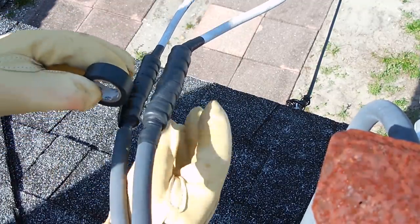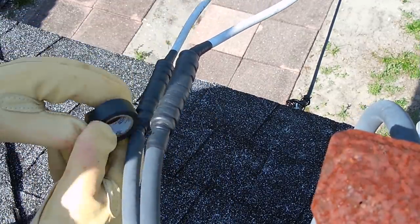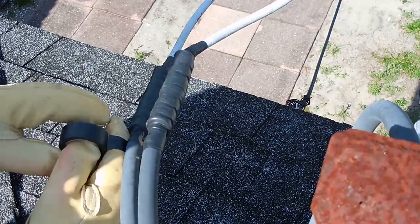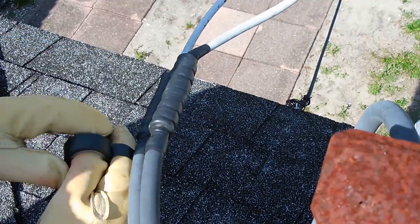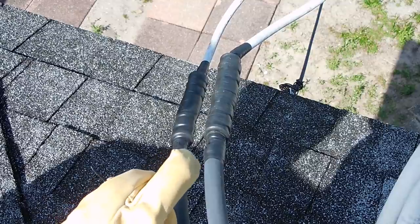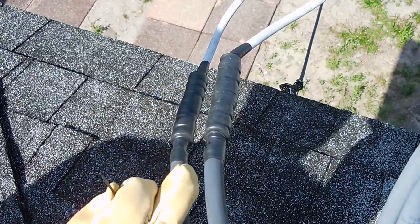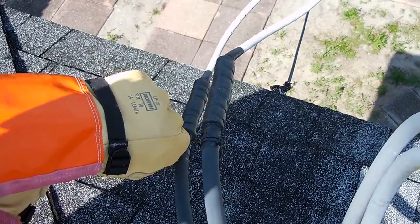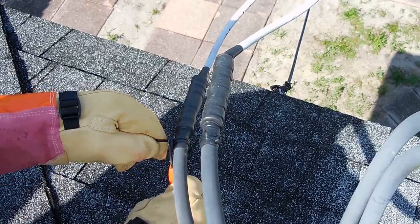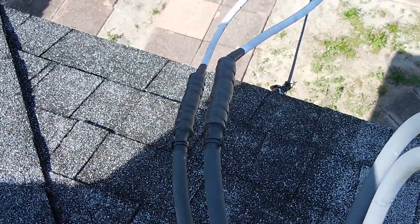A few layers in this area here where there's that depression with no insulation — give it a few wraps, thicken that area up. Now let me head back this way again. With both of these wraps, what I'd like to do is at the very end place two nylon ties over that end and that end, and that prevents all this from ever unraveling as the sun heats it up in the summer. That looks pretty good. No more problem with having these close together — if they did bump, you got the insulation on the wiring.